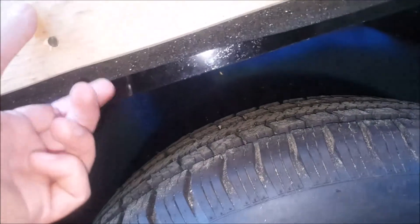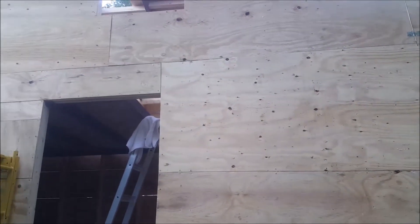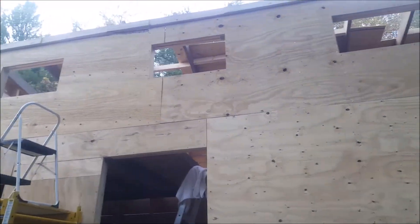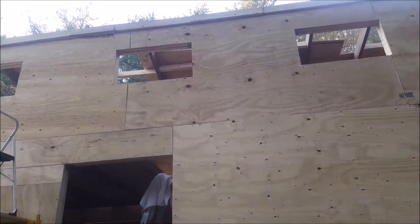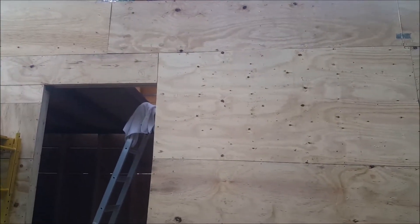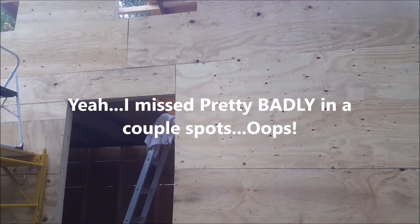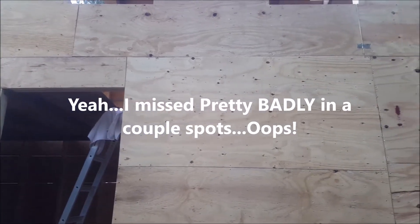For the time being, I went back with some of the stuff I used for the subfloor — the asphalt paper — and stuck it in between here. Then I'm going to go over it with window tape when it comes in tomorrow, just to get a little more of a watertight seal. One more thing: snap chalk lines where your studs are. It makes it a lot easier when you're rocking down the line with a framing nailer. I did not do it, but if I had to do it over, I probably would have.